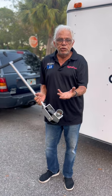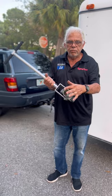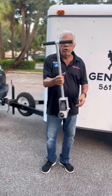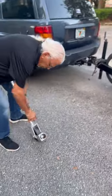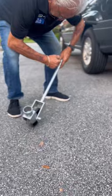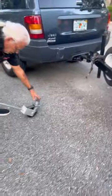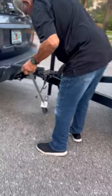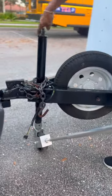You can put a cement block underneath it, you can even put a shoe underneath it, but you can also buy the wheel with the receiver on it. Then you simply hook the T-Bar to the wheel, just like this. When you want to use it on your trailer, pull it over here just like you would on the boat, pull the pin, extend the handle, place the pin, place the wheel underneath the trailer, and simply crank the pipe down into the trailer.